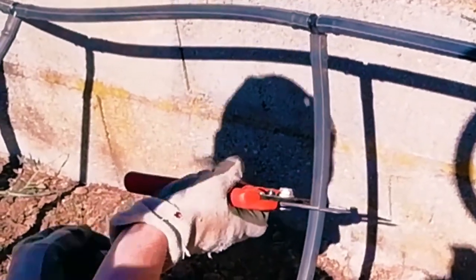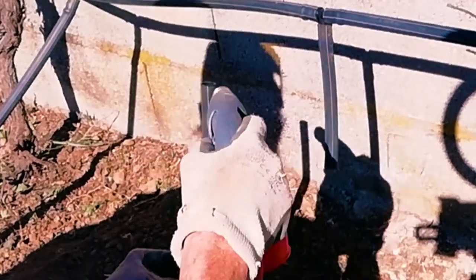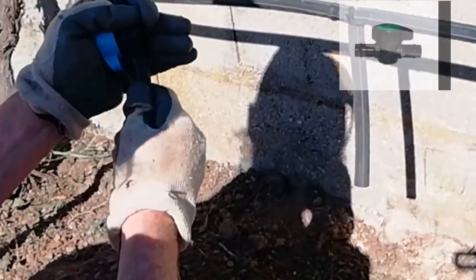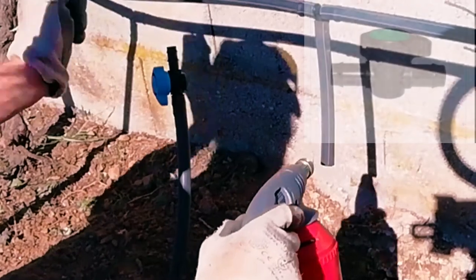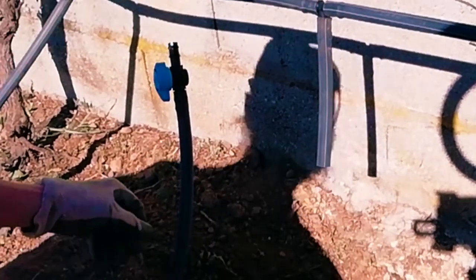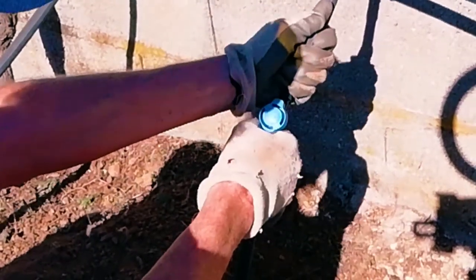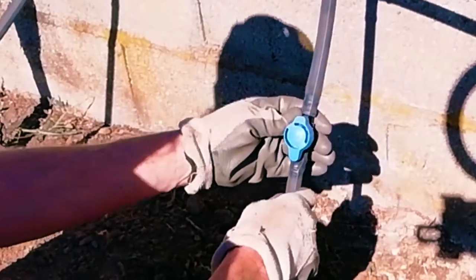Because we have a large irrigation system, water pressure can drop, so we decided it would be a good idea to put some taps on each individual irrigation pipe so you can turn them on and off when you want. To put these taps in you just have to heat up the pipe again with a blow torch like you did for the T-bar — but please remember to wear gloves, the pipe gets so hot and it's sticky plastic and it can burn you.